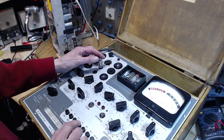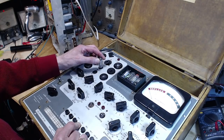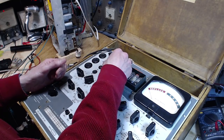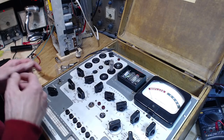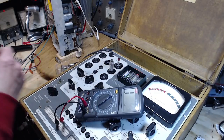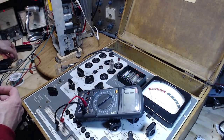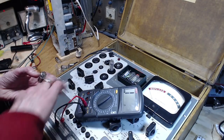Staring very intently at the meter while I wiggle this. But you know, there was no flash here. It's another bad tube. You know what I said earlier about, betcha the filament is open the same way. I can test for that. Now you kind of expect a tube like this, if it's going to fail with an open filament, it's only going to be one side. So this is the one that has the one side failure we know about. This is the one that was spare in the radio.